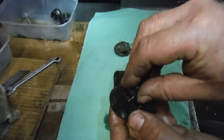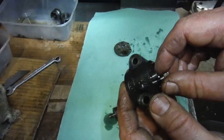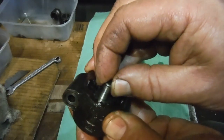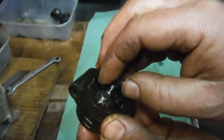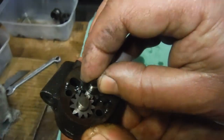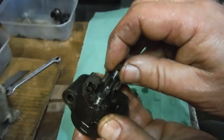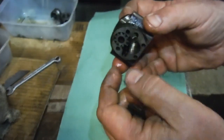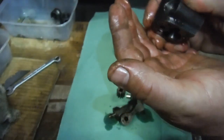Talking of the feed side, here it is. I'm not sure if I've necessarily got these gears the right way around at the moment, but it doesn't matter just to demonstrate — that rock or wobble on that floating spindle is still present on the pressure side, and I can also wobble the gears on the pressure side in the housing a little.